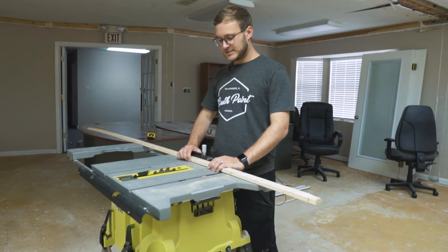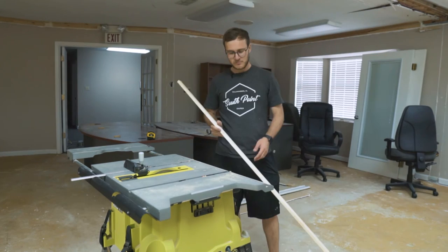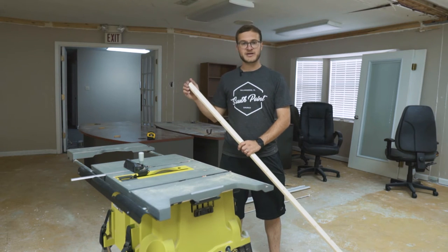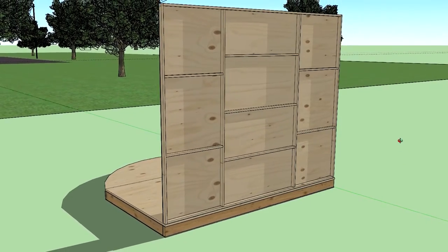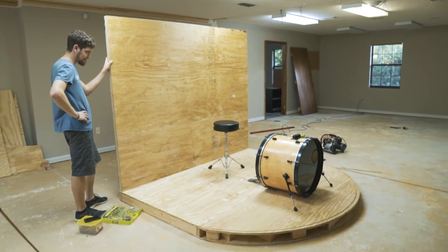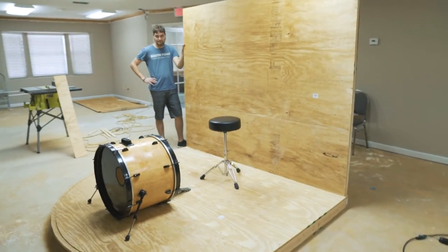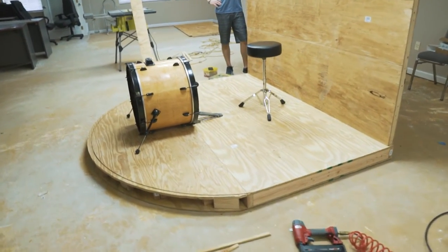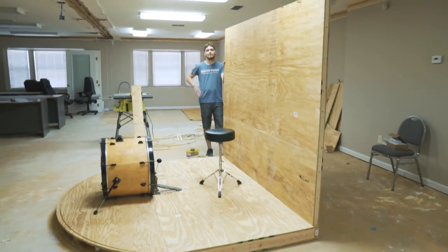We lined up our mark and made our cut. On our back wall, the studs are made out of 1x2s to cut down on cost and weight — as long as it's rigid it'll be good to go. We got our back wall studded and framed out with 1x2s on a quarter-inch piece of plywood, and we're about to cut the next two pieces and put them on the other side. We're going to put some more insulation in these boxes before we screw everything down. We held the back wall in place with the kick drum and seat for reference — it looks like there's going to be plenty of room. We also checked the polycarbonate in our groove and it looks like it's going to work out perfectly.